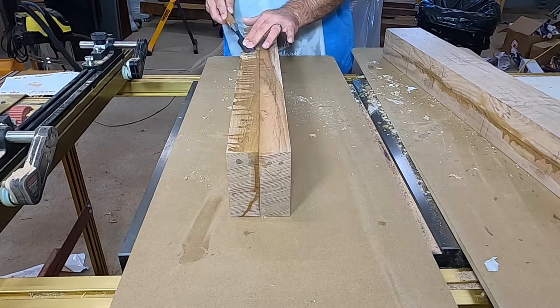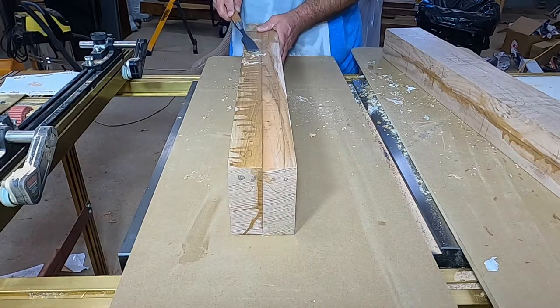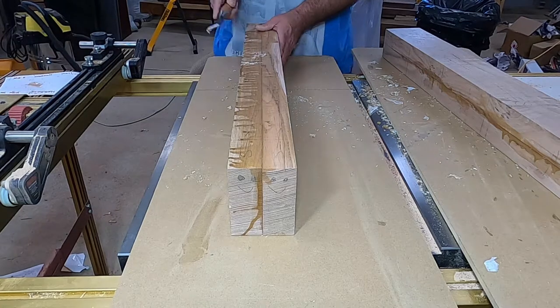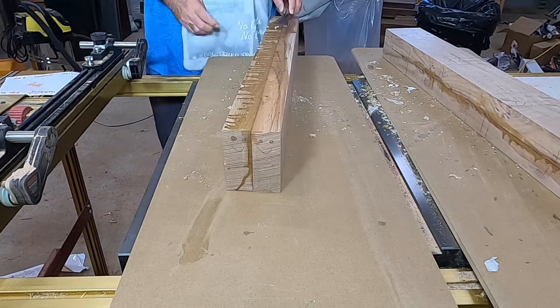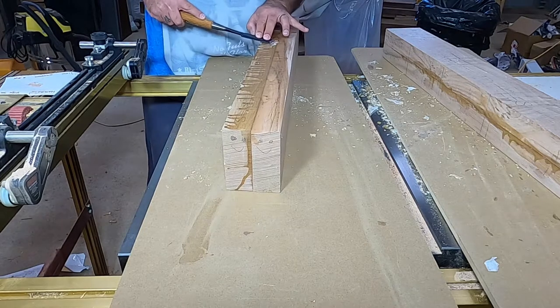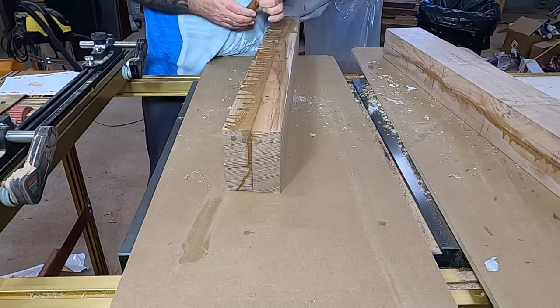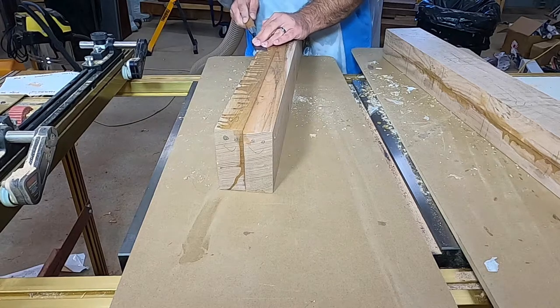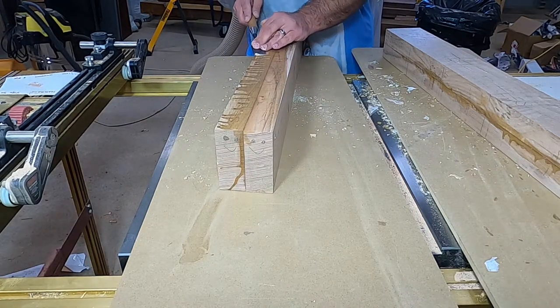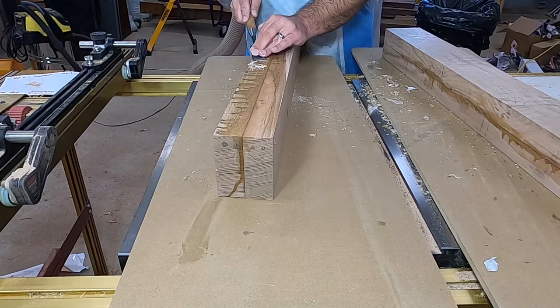Timber is an organic product, as you know, and it will move. So I was expecting having to remachine these, which is the reason why I left the timber oversize. If I machined it down to the exact dimension of my plans, which is in my head, I might add, then after this second stint of machining and truing up, the thing will be smaller than it needs to be. Leaving it larger means I won't have any issues with two spindly legs.